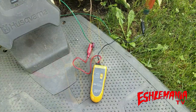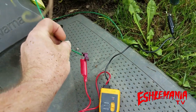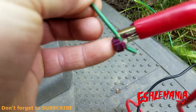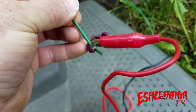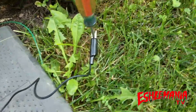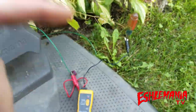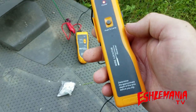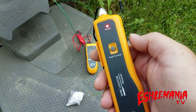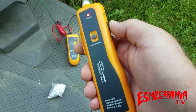This part here just hangs down and picks up the signal being transmitted from the transmitter. Here's all you need to do: pull off the wire you've determined to be broken and connect your positive to that wire from your boundary system — metal on metal, open the clip to get a good connection. The other side is your ground — connect it to something metal you can jam in the ground, like a screwdriver, so you get a good clean connection from your gator clip. Now with everything hooked up, power on the receiver and the transmitter will send a tone through the wire.